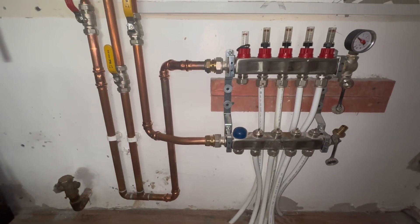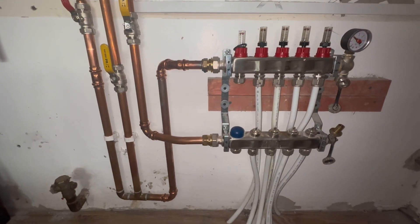The way this heating system is currently set up is fully zoned — we've got a zone for the living room and dining room, zones for the bedrooms, and another one for the hallway. When it comes to heat pumps they don't work as well when it's zoned; it really destroys the efficiency. So we're going to be removing all zoning from the system, removing the pump and the blending valve from the underfloor heating, and taking all the zone valves off the top of the underfloor heating as well. That way the heat pump and weather compensation can control the whole system and it should be much more efficient.